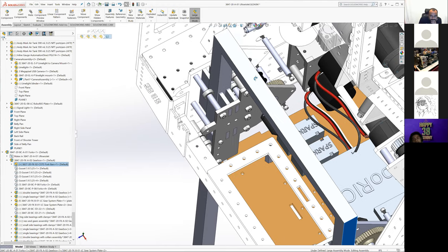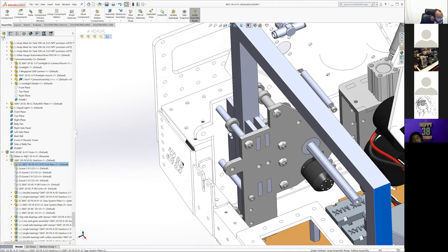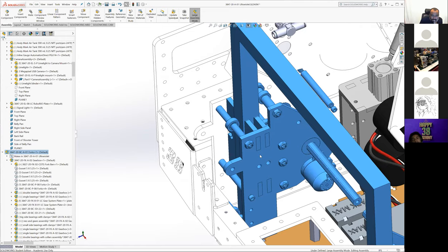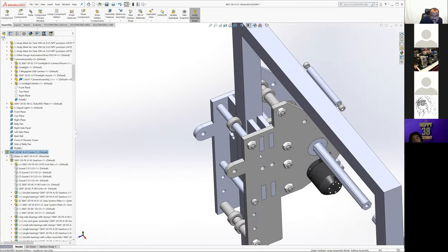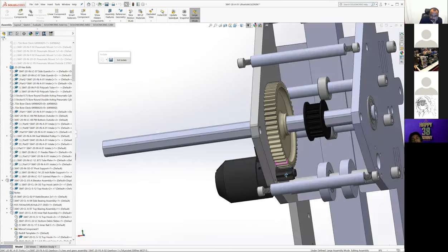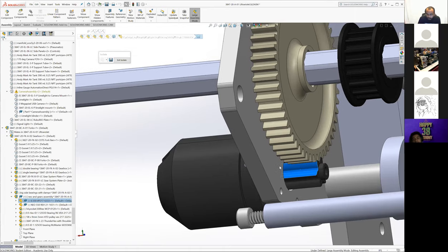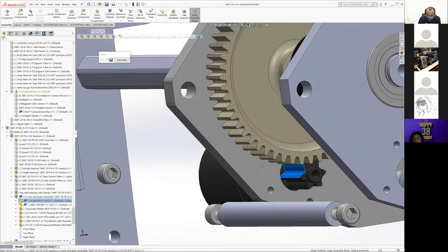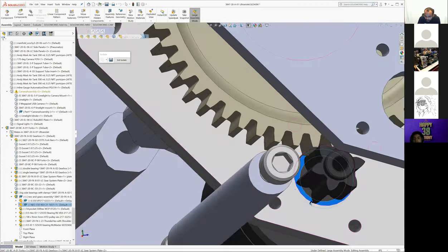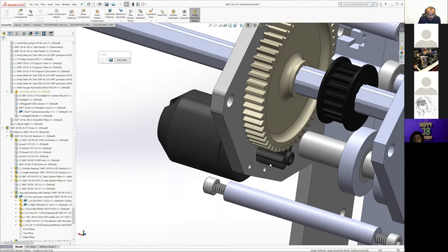We originally did these with Versaplanetaries, and then we switched to a Neo 550. There's a 54 tooth gear, and then it's running to an 18 tooth pulley with the whole belt system. We were using the new DP, like the 6 tooth gear down here. Nice and tiny. That gear is awesome because it fits through the Neo 550 pilot, which is really cool. It's the first time we ever did any of those.